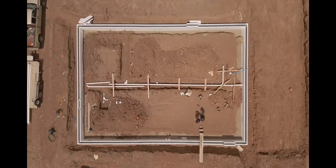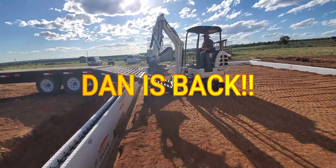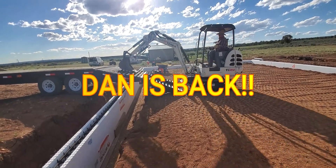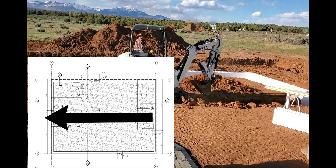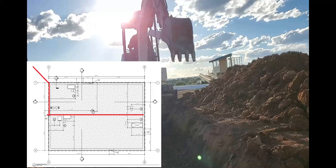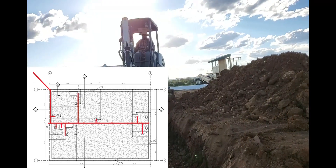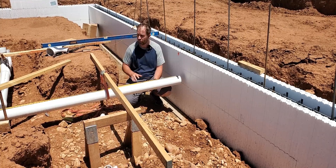The first thing we're going to design here is the drainage system. We are going to trench out of the earth one main trunk line, basically running down the center of the long direction of the home. Then we will take each tub, shower, sink, washing machine, and we're going to trench to that main trunk. So those are the branches.